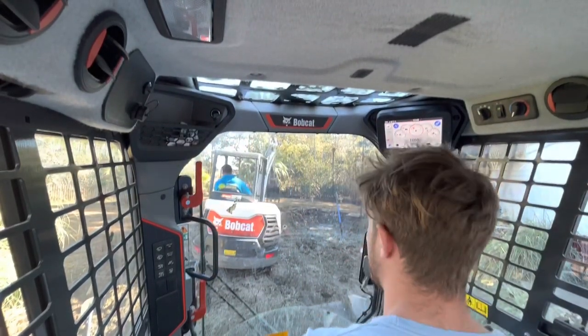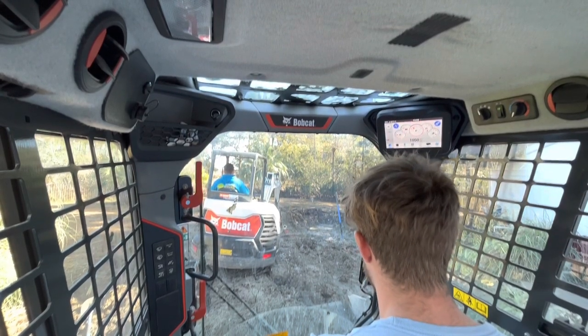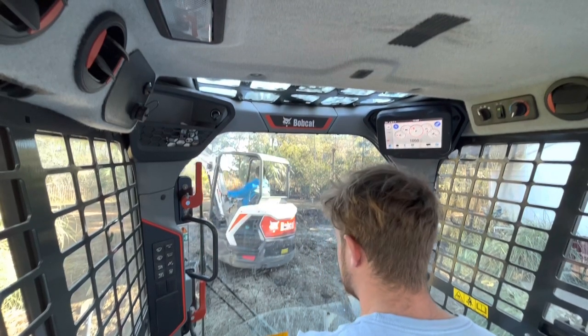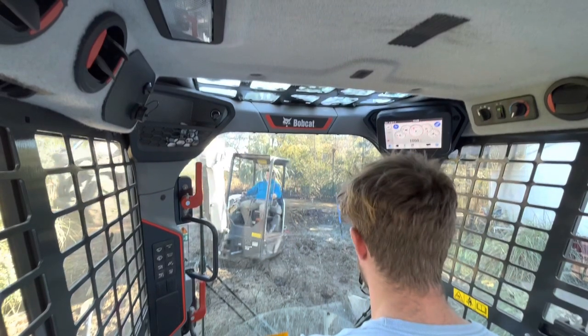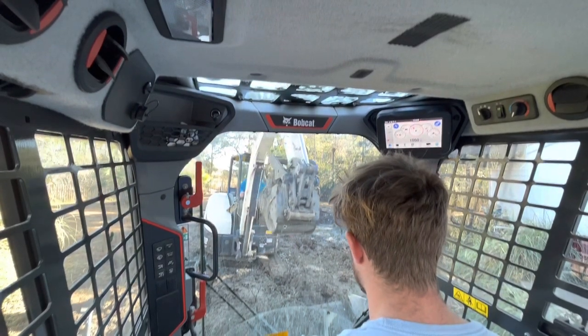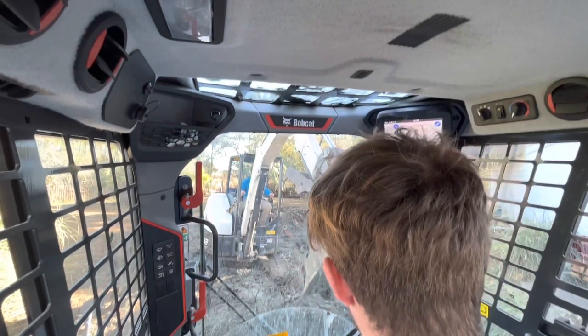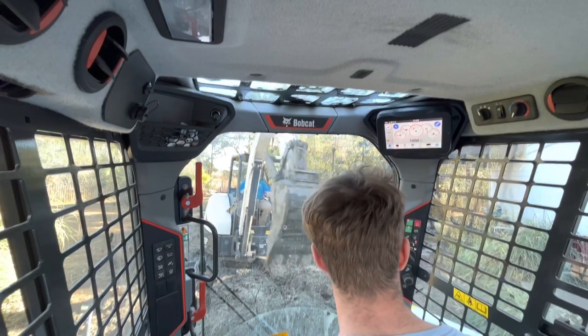Excavating somebody's backyard that is right on the water column, like 2 foot under the layer of sod they got in their backyard. So we're having to excavate a good 4 foot out, get some bigger gravel in there for our pavers to have a solid base. So that's what we'll be spending most of our time doing today. And then hopefully we're going to get some 3 to 5 inch stone in here, and then 57, then we'll get rolling.